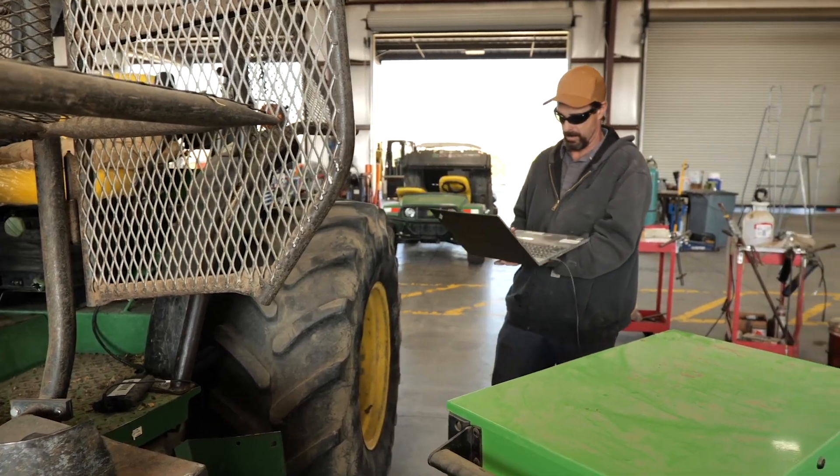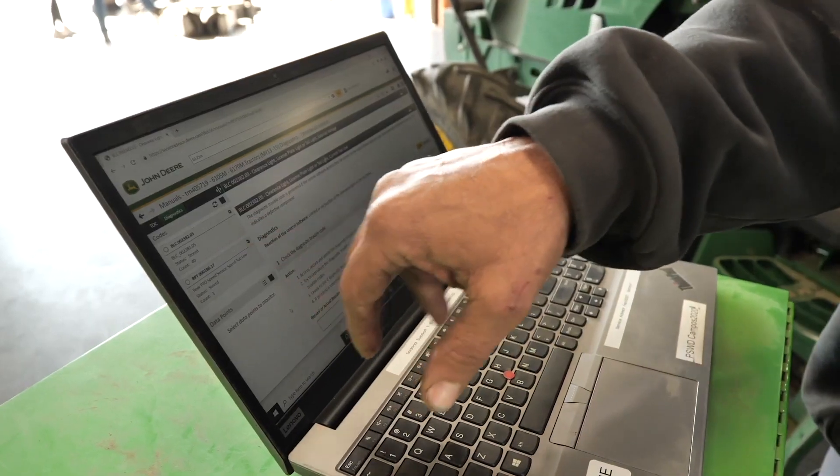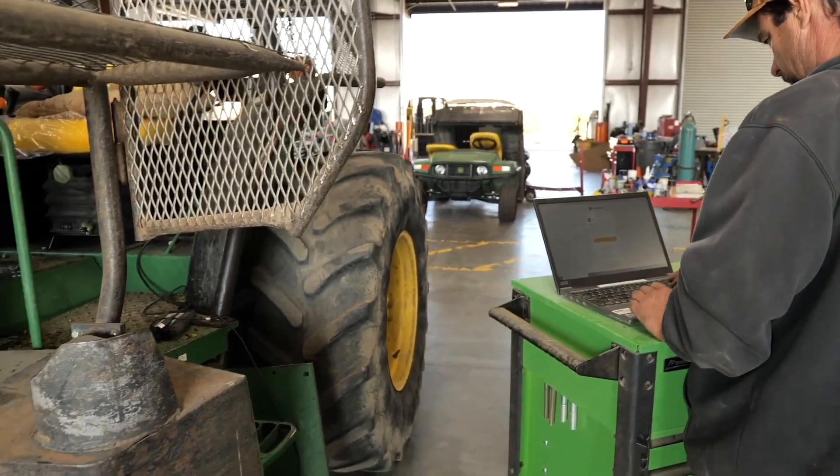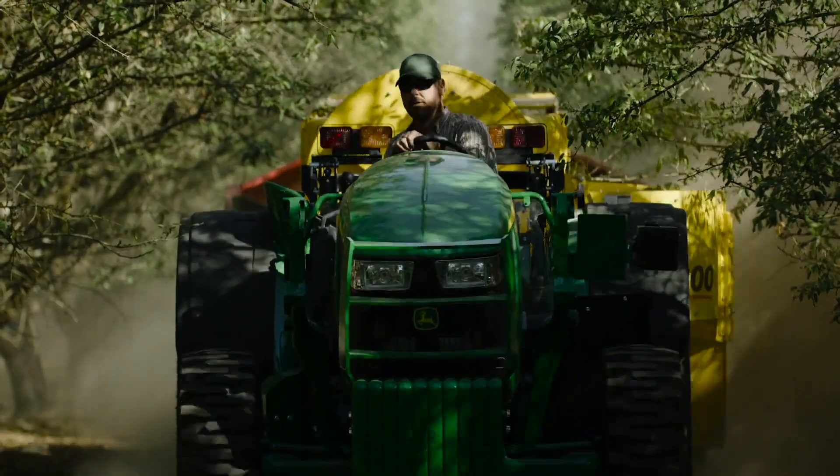Customer Service Advisor has brought to us a way to look at all this new equipment from the inside out. It lets us look in it when we have an issue instead of just guessing and going about it the old school way. It's a modern way of working on equipment. When a machine comes in or has an issue, we can look up all the previous codes in it, address issues such as overheating, running out of fuel, running low on DEF, not doing proper regens — so we can keep our operators informed of how to operate that piece of equipment. It helps us to be more efficient at what we do.